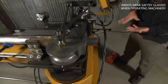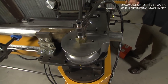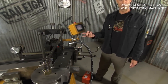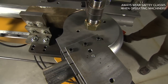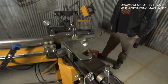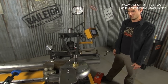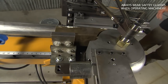The machine is going to go ahead and clamp it. It's running the mandrel in from the back, and most of us know the mandrel is what smooths out the tube as it comes around. I haven't done anything other than hold my foot down, and it's started to bend. Now when this thing finishes the bend at 180, it knows that it's at 180, it'll stop and unclamp itself — I'm still hands free. And here we go. It magically knows that it's pulled itself off.